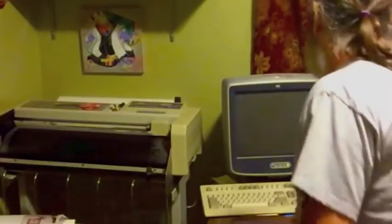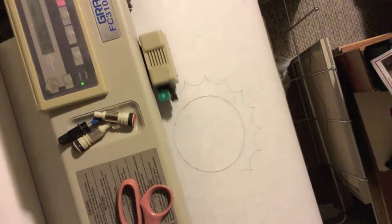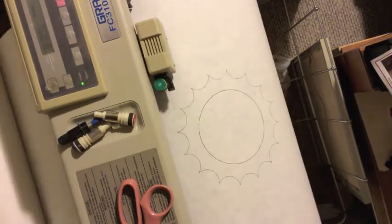If I fire up the mighty computer and lay it out in a CAD program, I could just grab that shape by the corner and drag it up to the size that I wanted, which is not Euclidean methods, but it's going to work. And that's what I did. I laid it out in the computer, plotted it on paper with the plotter, took the paper pattern, transferred it to plywood, cut it out of plywood with a saber saw, had it primed, painted, and installed in a few days.